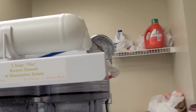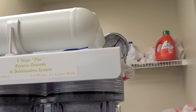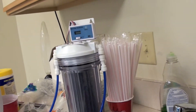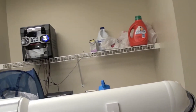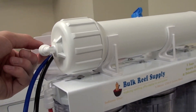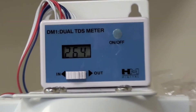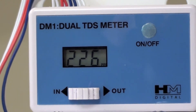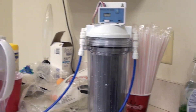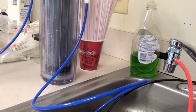The pressure gauge is really going crazy. I think it's still just going through the membrane at this point - I can feel the water going through, it's just kind of vibrating. It's in the DI now and the TDS meter is going nuts. They said it takes 10 minutes of running to be accurate, but it was reading like 400 or something - probably just carbon block residue making it read high. No good water yet but gotta give it a little bit.